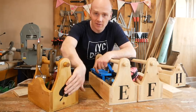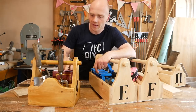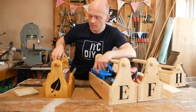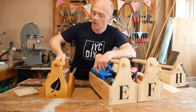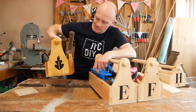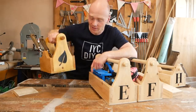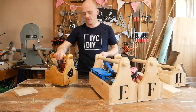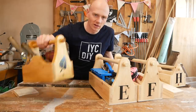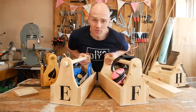And then lastly, our little garden caddy — exactly the same shape on the ends. I went with higher sides just because I was using up off-cuts of that length of timber. For this one we used Osmo UV Oil, from an old tin that needed to be used up. It probably needed rubbing back and another coat — it was a bit of a rush job — but redwood is fairly durable for occasional use, and with that on it, if it gets left out in an odd shower it would be fine.